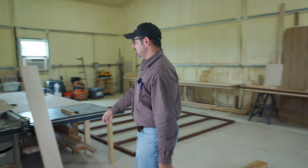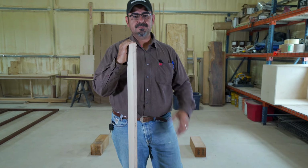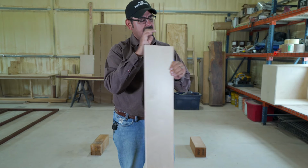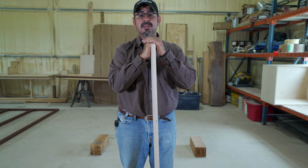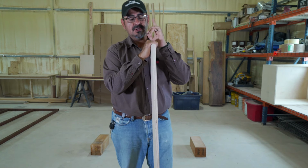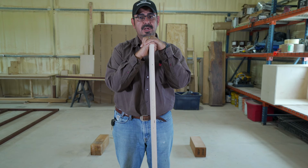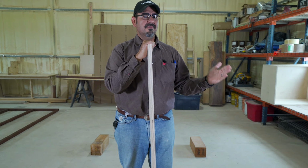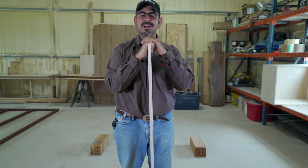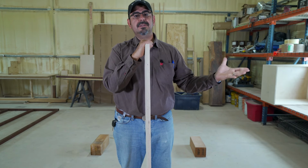So let's do this. I'm gonna take this 3/4-inch plywood, 5 feet long, and this is gonna be our 4-inch slab. You can have a 4-inch slab on grade, simply reinforced with fiber. That's one. Number two, you can have a 4-inch slab on grade, reinforced with mesh wire. Now, here's another variable. Mesh wire comes in 6-gauge and 10-gauge. So just because you say mesh wire, I would ask you, well, which one? The thick one or the thin one, right? So now that's mesh wire.